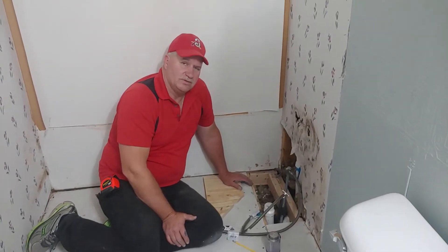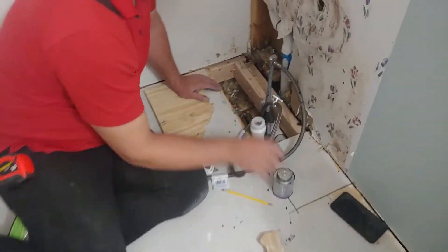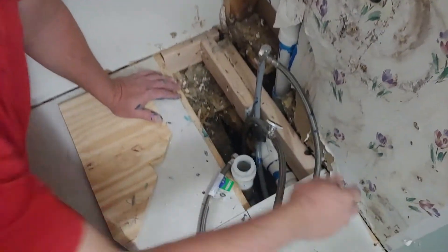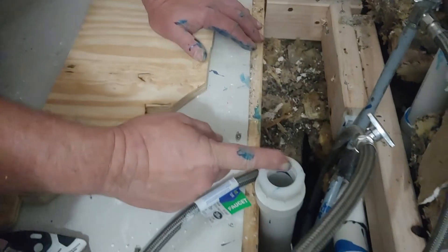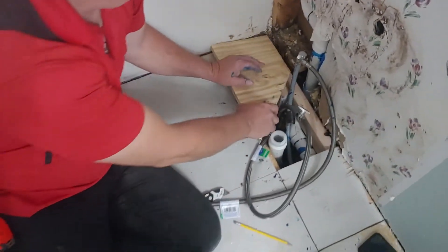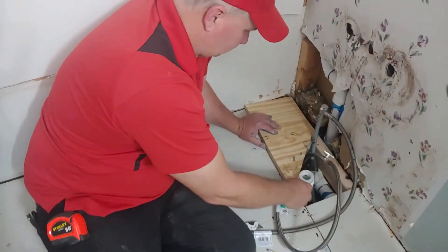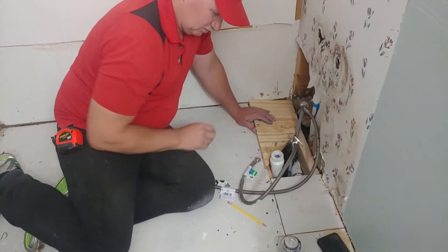Look over here — we'll show them all the plumbing we did in here. The vent was hanging out in the floor; we had to get that into the wall, so we cut into two-inch pipe, put an adapter, put a tee right in the trap where it needs to be. Then the vent has to go back up through the wall. We've done all that and repositioned the lines so they're inside.